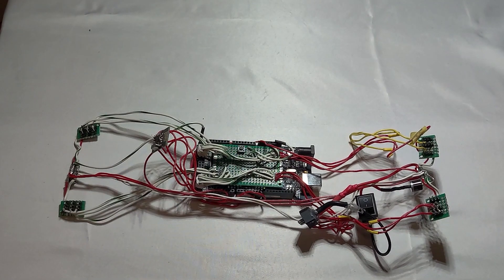This is the circuitry. Instead of having a 10-minute video of a complete breakdown of components, I'll just sum this up. I have the NRF24, which is responsible for communications between the robot and my controller. I have four sectors of servo outputs which feed the rotational angle and power to the servos. Then I have the battery connector — specifically the XT60. I designed and printed it, and it only cost me 58 minutes of my life and two pennies. There's no stored charge in the circuit, so unwanted shorts are not going to happen, and it fits perfectly to the battery, making it safe.